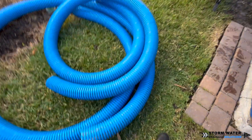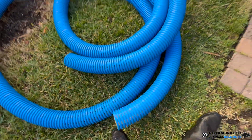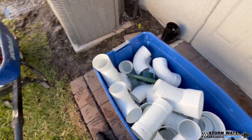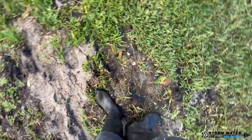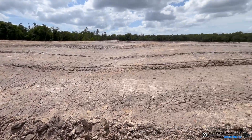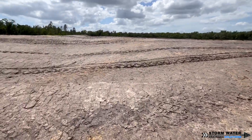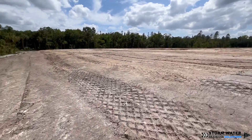For our French drain we're going to be using the FDM high octane slotted drain pipe. This has perforations 360 degrees around the entire pipe, which allows for max water and air flow. You can see how saturated the ground is here — it's holding water. The reason for this is because when developers build homes in Florida they elevate the land with dirt and clay from retention ponds, creating pockets of clay between homes where water cannot percolate through to the subsoil.